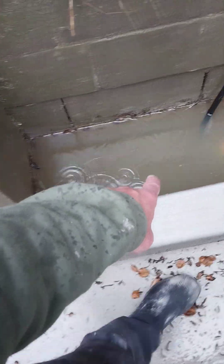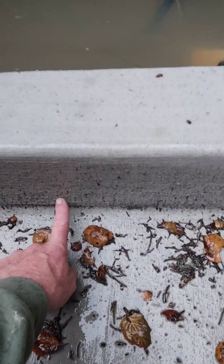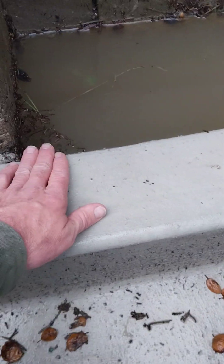We're going to look for other flooding spots. This is all clay so it should saturate and hold water. We want to avoid holding water if we can but we couldn't do anything about the clay layer — we can add a lot of sand to build up the layer and that's probably what we'll end up doing. This is full — that's now a little pond. Water weight and hydraulic pressure are significant, so we may come in and punch holes in this concrete to add a drain so that this water drains out.